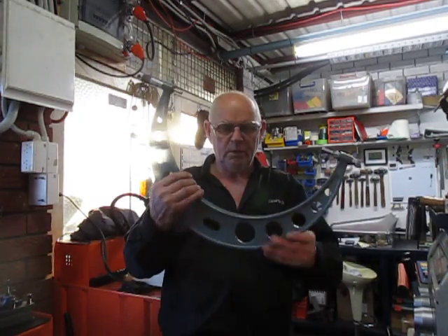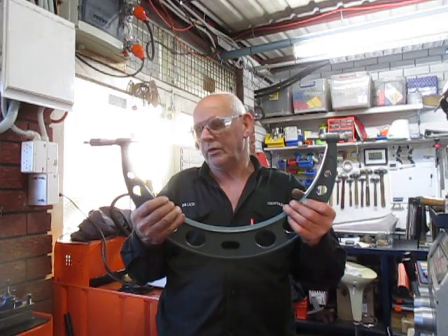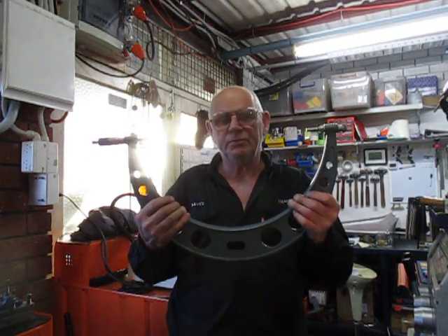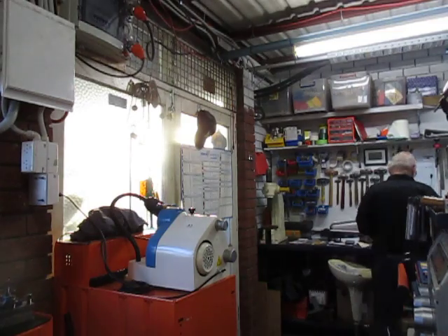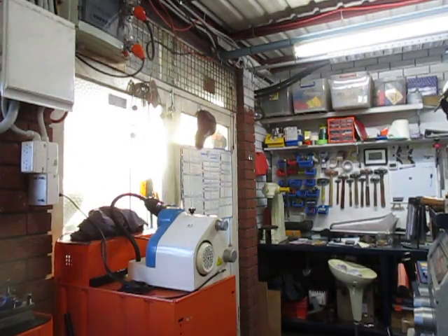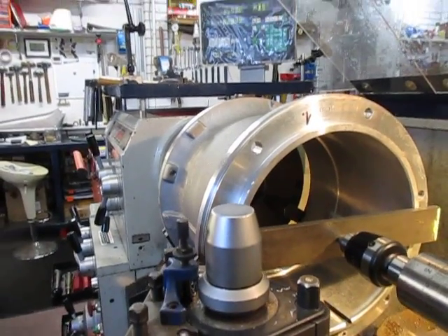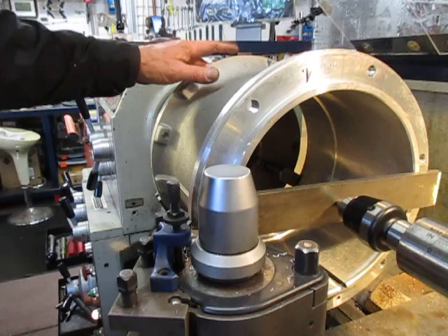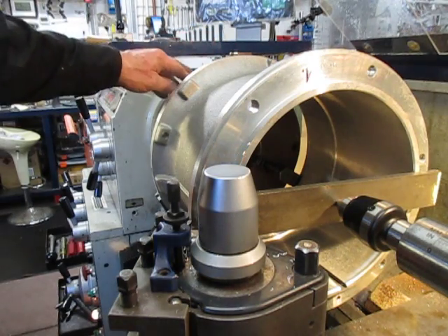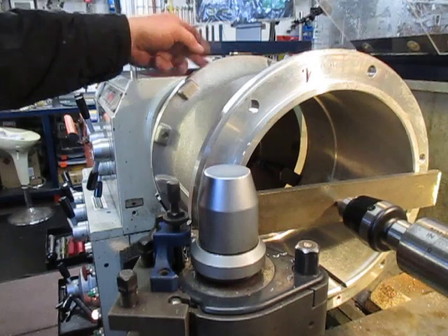I've had to come out with a medium size micrometer and I've got a couple more — I go up to about double this size. So what we have here is the housing. We've got it in the chuck, in the regular three-jaw, and with the jaws opened out to grip on the inside — we've got a facet inside there to grip by.